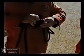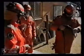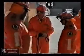It is. And all you're doing there is just removing one single... That pretty much looks like it. And the thing is, when you shock load, like I did a test with this, I had this on one side attached to a vehicle and a normal figure 8 on the other side attached to a vehicle. And then I towed one vehicle with the other, so really bedded them in very tight. This one I undid, the other one I cut off and threw away because you just could not undo it.